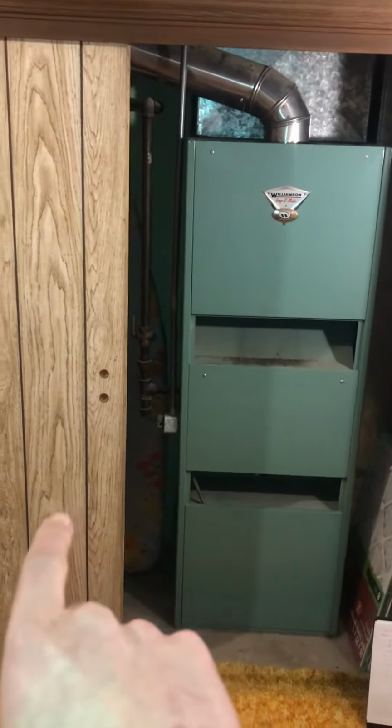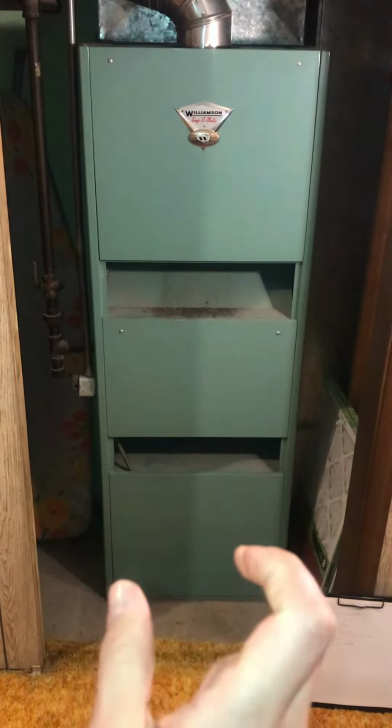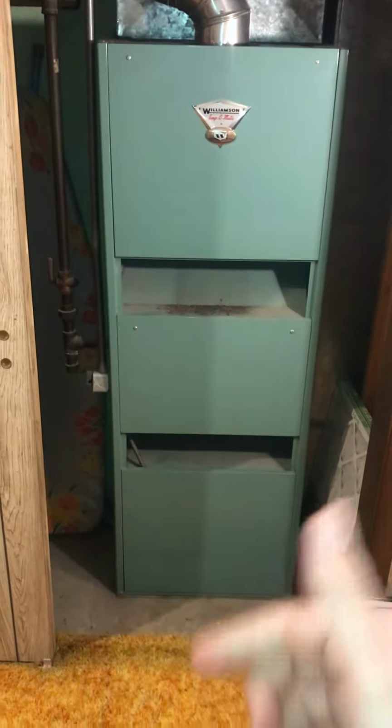And what I think would be best is if we just got a base can right here, put in the filter rack, that way he doesn't have to change it out inside of the new furnace. He can just pop it off and switch it out. It'll be a lot easier. And putting the furnace cabinet roughly right here, and then we'll have to build a transition if the cabinet's too much smaller, depending on the heat load calc. But that's basically what we're looking at, guys.